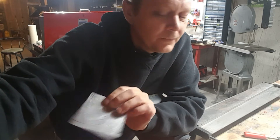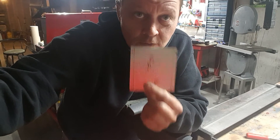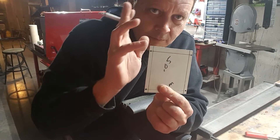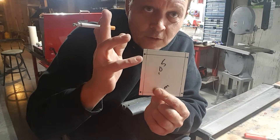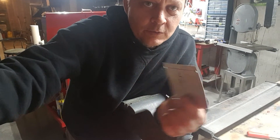So if you're ever doing bending with aluminum, make sure you're using a good bending alloy. Pretty much 5052 is the one I know of, and it's worked perfectly for me. We've already got it sized, measured, cut, and drilled out, because we're going to be bending these really tiny small tabs that are going to have the holes in them, and I didn't want to have to drill it later.